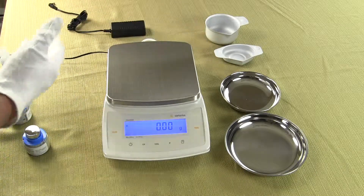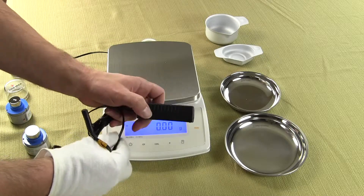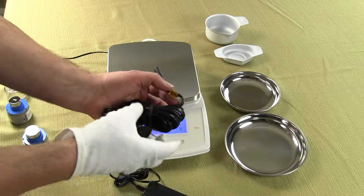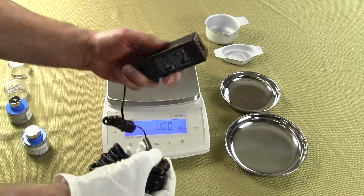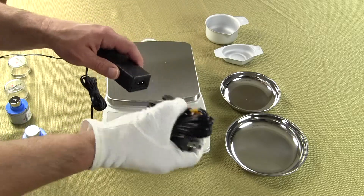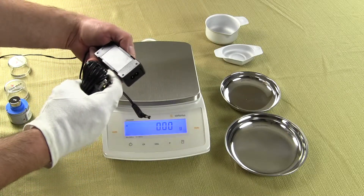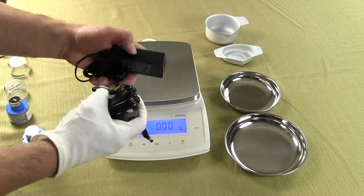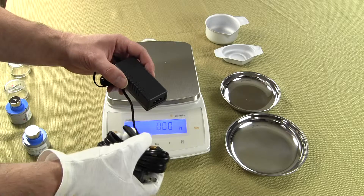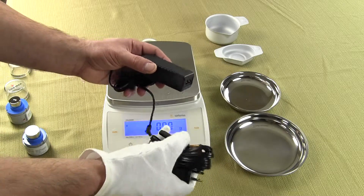The balance comes with a new universal adapter. We sell in the US, so they all come with a power cord for the USA. All you do is plug it into the power adapter and the adapter will automatically sense the input voltage. In the US we're dealing with 110V — it automatically senses it and then outputs the correct voltage to the balance, about 15 volts DC. With the new adapters, all you have to do is change the line cord. The older adapters were all one piece and you had to buy either 220 or 110. That's a nice new feature.